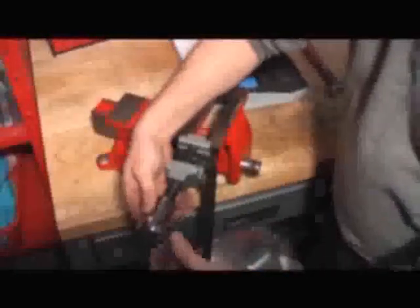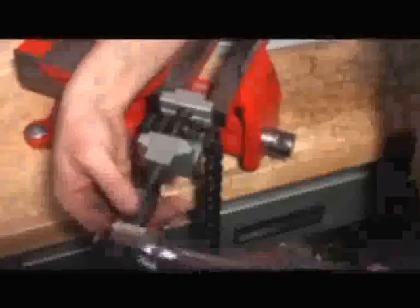Keep it in line, keep it in the right position — it's a delicate little job. We're going to tighten this up completely and drive the pin forward. Keep checking on the chain — we don't want to bend the links, we want to keep it perfectly in line. You can see here we're just ratcheting the pin straight the way through. Keep an eye on it, make sure it's level and make sure it's not on the skew.